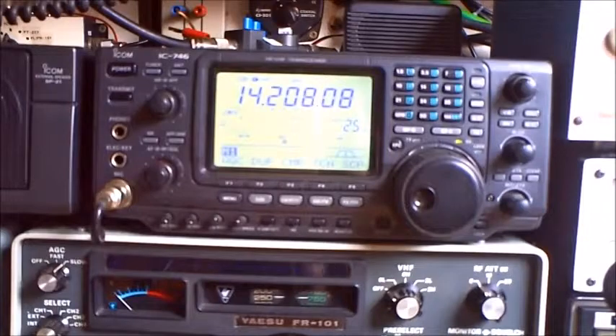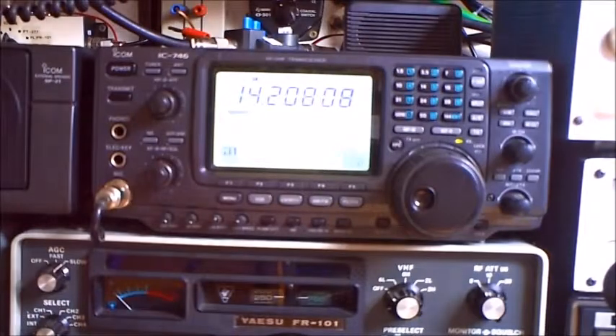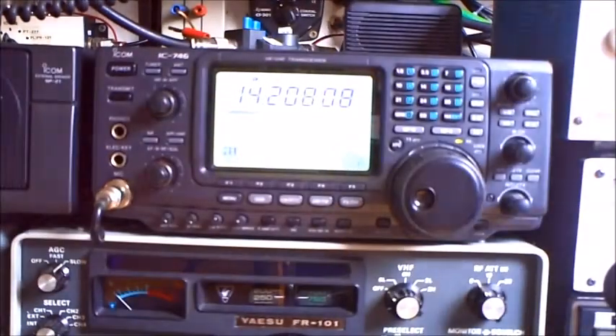This is Ukraine on 20 meters. The conditions are not so good. In the peaks S7, S9 — so 12dB the hex beam is better. But for near distance stations, a vertical antenna is always not so good, but here the beam is 12dB better.